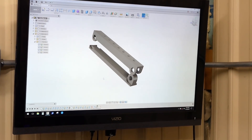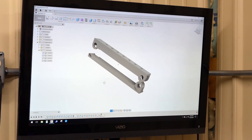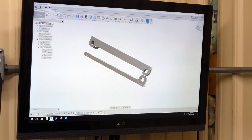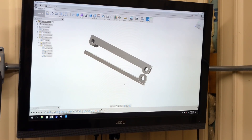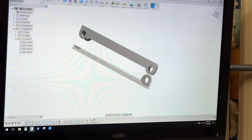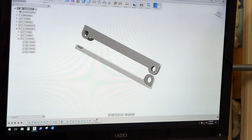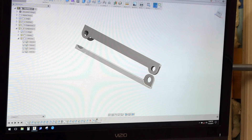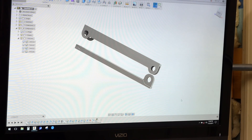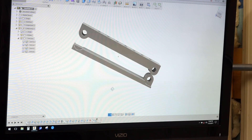Here's the design I have for the sine plate — it's going to be a low profile. The radiuses I talked about that we're going to swing in this video are these radiuses here and in here. This is going to have a top and bottom piece. The nice thing about this design is that even with the gap in the middle of the vise, this part will span both sides of it, allowing me to position it in the vise. A future version will extend that part out a couple more inches for more movement between the vise jaws.